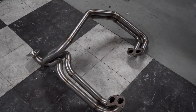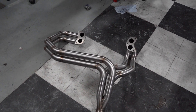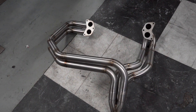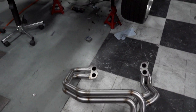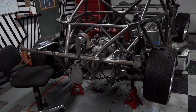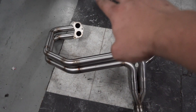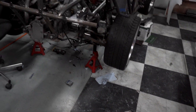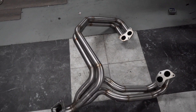These headers are done — done enough. I'm so happy with how they've turned out; they are very pretty sitting here and they will be even prettier sitting in the car. This right here is a slip joint, so these tubes can come out and make it into two pieces, because there's no way it could go in there otherwise — you'd be breaking the laws of physics, wormholes, you know. I've got to bang these out and make this two pieces: there's going to be this piece, there's going to be this piece, and then slide them both in and put it together. Let's get that in there.